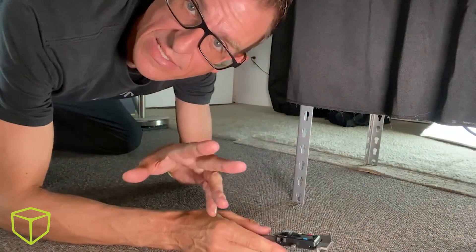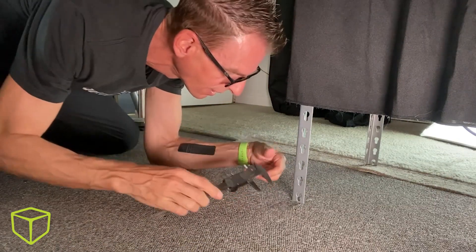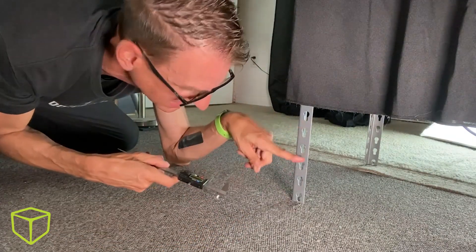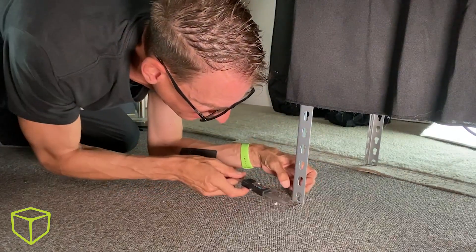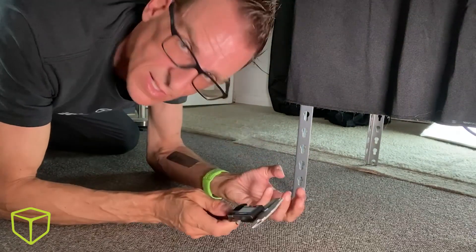To solve this I need to bridge a gap, so I'm going to measure up the parts that I need to fit. There's a consistent spacing with these keyhole slots because of the shelf height, so I'm going to use these at the bottom and measure those up. I'll use that to add a feature to make sure this new part snaps on and stays in place.